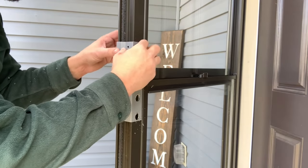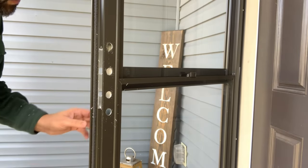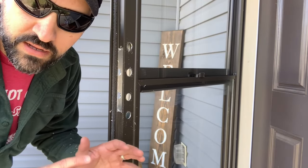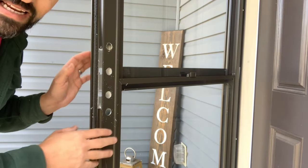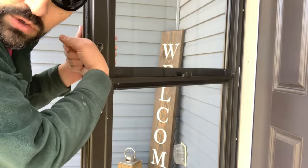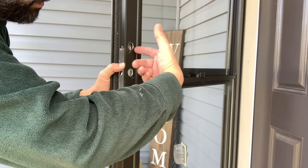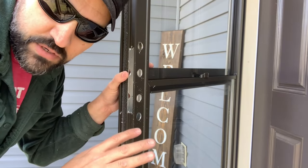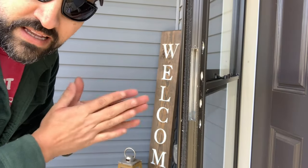All right, you can see I got all the holes drilled - one, two, three, four - using the template. Here's a tip: if you're watching this before you start, make sure you do not put your hand like this when you're drilling your inside holes, because you will go through all the way and get your hand. I had my hand down below so when I drilled it came out the hole without stabbing myself - just a little safety tip. I'm sure somebody's held their hand like that and come right through and done some damage.